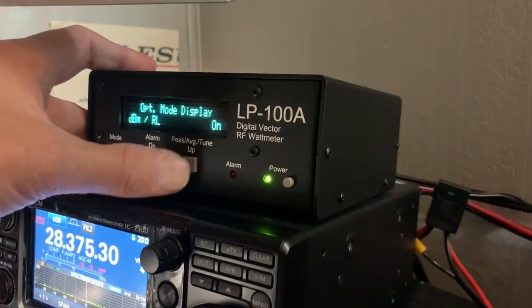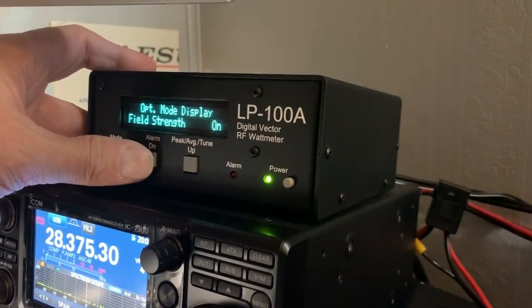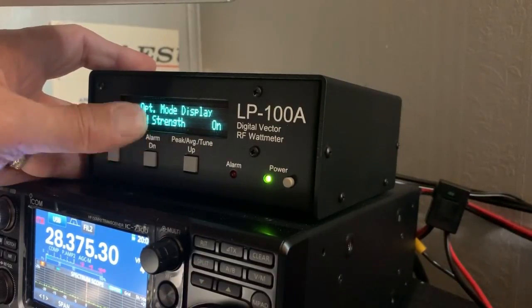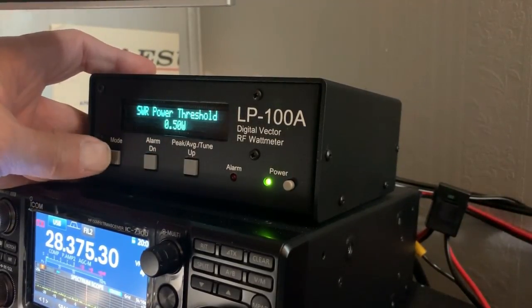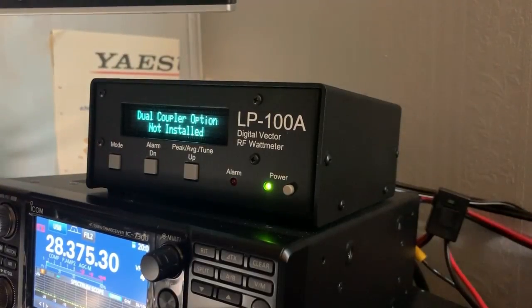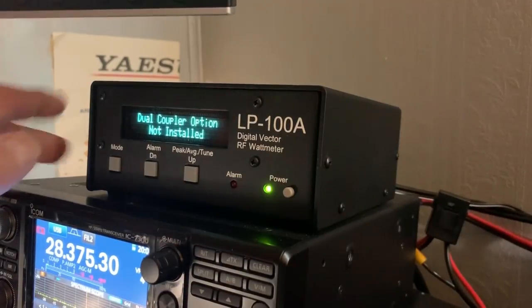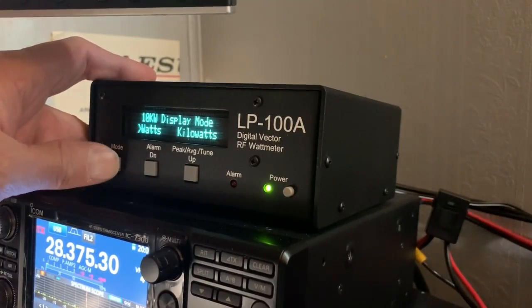These are your optional modes. You can hit the down button and switch through the available modes, which include field strength, compression, and the DV mode. If you hit the up button, that cycles them on or off, so you simply switch through and pick what you want. These are the rest of your basic setups. You have a dual coupler option — a very inexpensive board you can add on — and you can have two couplers which automatically switch between radios for single-operator two-radio contesting stations. That gives you the settings for how you want your watts to display if you have the 10KW coupler. And there we are back at the start.